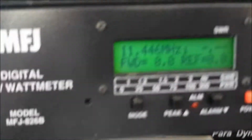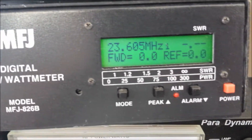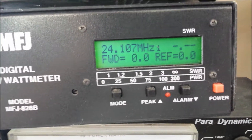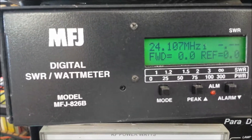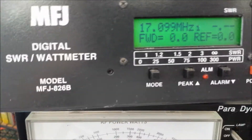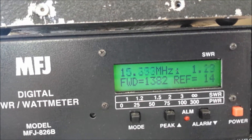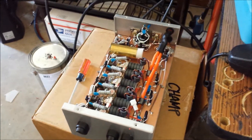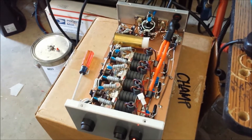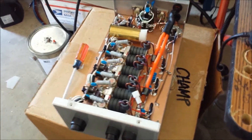Let's go ahead and kick the old 6 and see what we're going to get out of her — should be around 1300. Almost at 1400. SWR looks great — I am keying on that antenna with about six or seven jumpers in line, so that is pretty good. We got 1400 — it's starting to get warmed up. About 1350-1400 watts. That's pretty good in line with a six-pill — that's not over-driven, that's tuned perfectly. On a Bird meter, less than half a watt of reflect — we're talking like 300-400 milliwatts of reflect. It don't get no better than that.